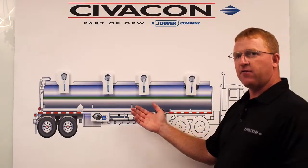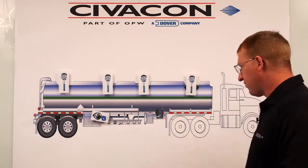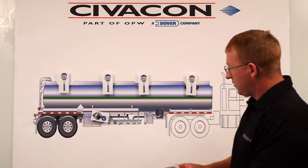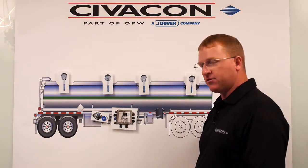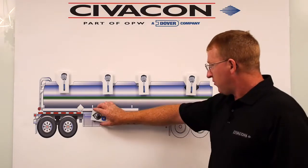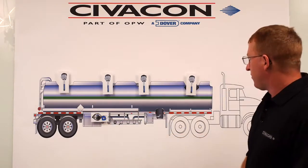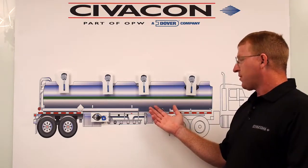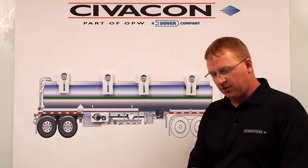Notice on the 5-wire system we're working with here, there's no onboard monitor like in the 2-wire. On a 2-wire, you typically have an onboard monitor that helps you troubleshoot the system and the faults with it. On the typical 5-wire like we're dealing with now, it only has a blue socket or the optic socket. The only way to effectively troubleshoot this is with some sort of tester like the one we showed previously in the film.